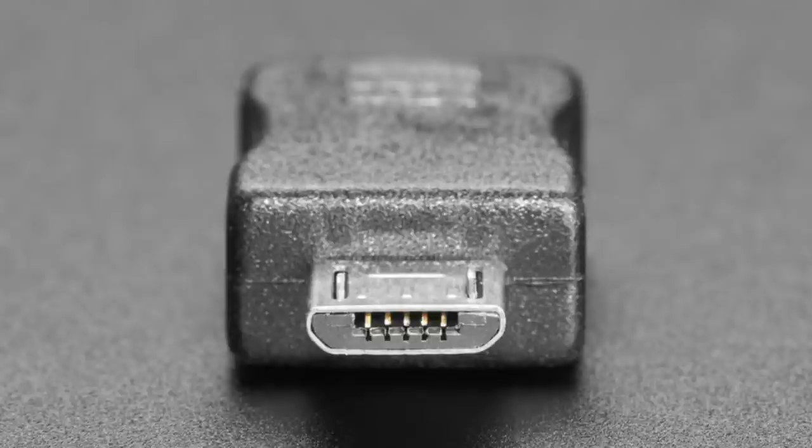I did open it up and there is a resistor. It's epoxied, so I couldn't really open it up and show, but there is a resistor inside, and I think it could be useful for other stuff as well. So Samsung phone debricking, go for it, but anything else where you need to convince a device that there is a USB On-The-Go cable attached with the ID pin connected to ground, this might be handy, and tell us about it because we'd love to know why.